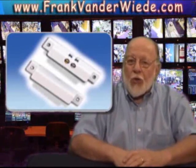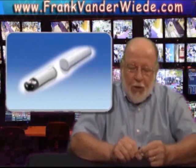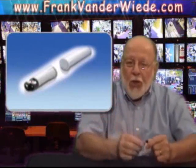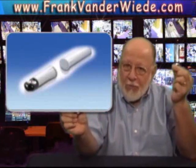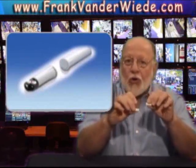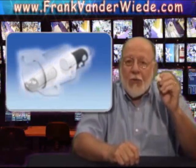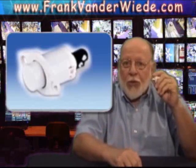There are a couple other kinds of sensors you may want to use on your doors. Instead of having a surface mount, you may want to have a recessed sensor. This particular switch is 3/8 inch round. You would drill a hole in your door frame up into the attic, pull the wire down through that hole, connect it to your switch — there are screw terminals here — push it right up into the hole in the door, and drill a hole so it lines up. When the door is open, the magnet would move away, telling the alarm that the door has been opened. This particular combination is very popular for inside doors with wood frames. There is also a plunger. If your door has steel in it, a plunger might be a good answer because the steel will eventually become magnetized and could cause you a problem with the magnetic sensor.